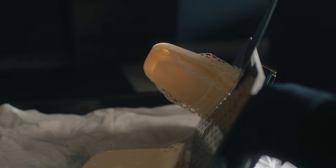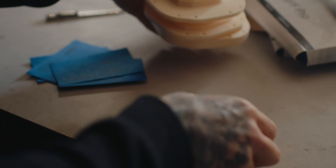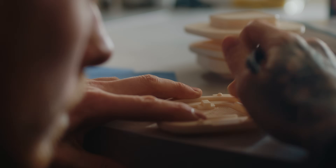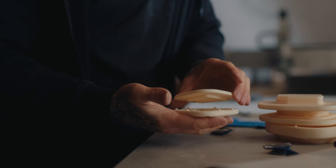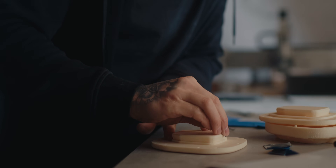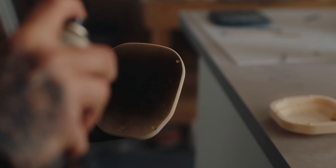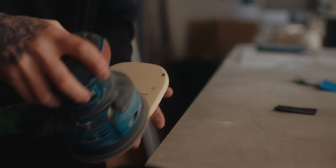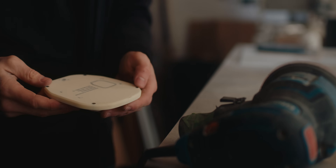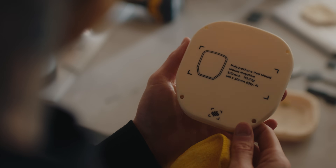I'll leave more details on this down in the video description. Before I can use these parts, I need to prep them by removing the supports, washing and curing them. Then I can clip and sand off the remaining supports, going through the grits from 120 to 400, being careful not to dull any of the details inside the mould cavity. I've been as strategic as possible with the support placement to make sure they're not attached directly to any detailed areas. In the CAD model, I've also added information to the moulds on the outside surface — I set the text in by 0.5mm so I could paint it, then sand away the top surface, leaving the paint behind inside the text. Honestly, it's just an excuse to make the moulds look cool.